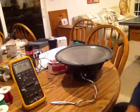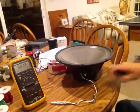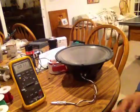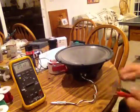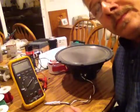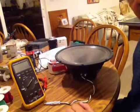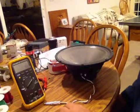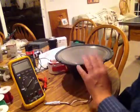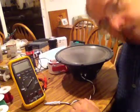It does not break the cone in as quickly as it does the surround and the spider. But there is a marked difference when you build a new amp and you don't get that loud volume and play time — that will do it very effectively. So: take the wattage rating of the speaker, 50 watts, take a third of that, multiply it by the ohm rating of the speaker, take the square root of the result — that gives you your voltage reading. This one happened to be 11 and a half volts. So there you go from Dalmar's Music and Sound.